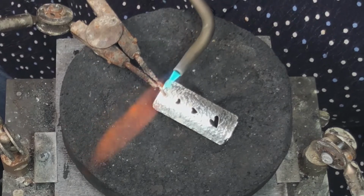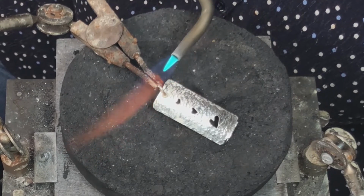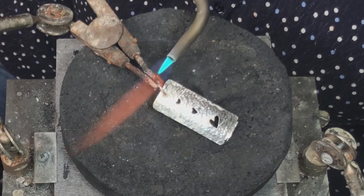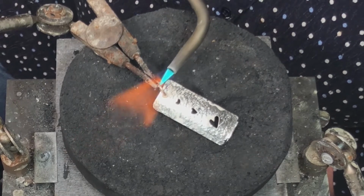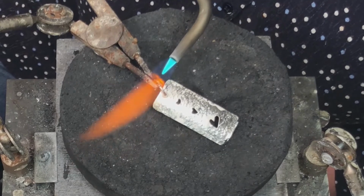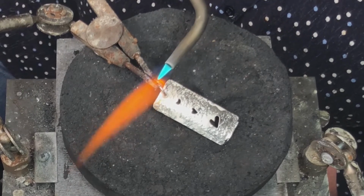That solder is sitting right on that seam, and as soon as that jump ring gets hot enough, it will flow. Now it'll take a little longer than normal because this third hand is going to act as a heat sink and pull heat away. Now it's balled up, and sometimes that concerns people and they stop. But you just keep going and it will flow.